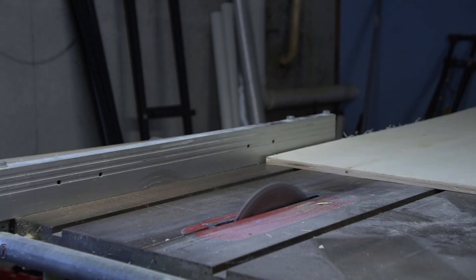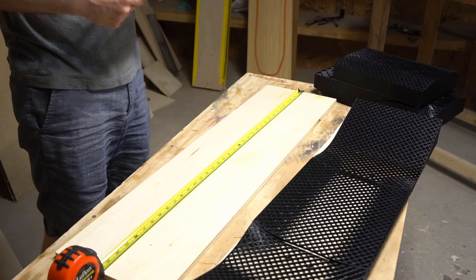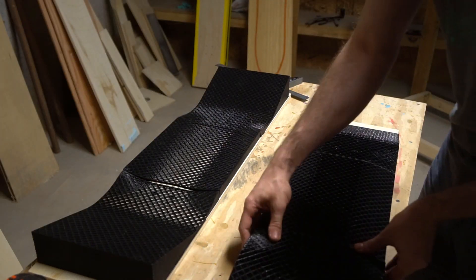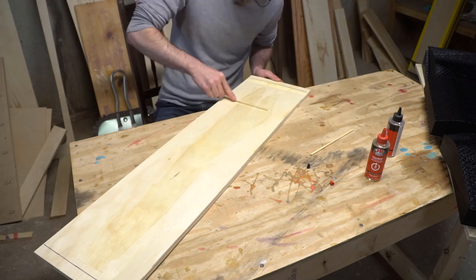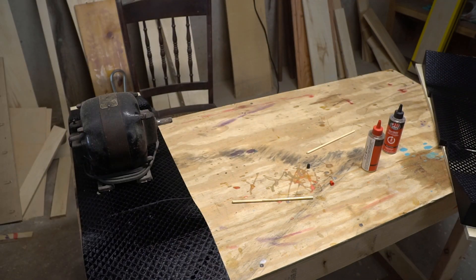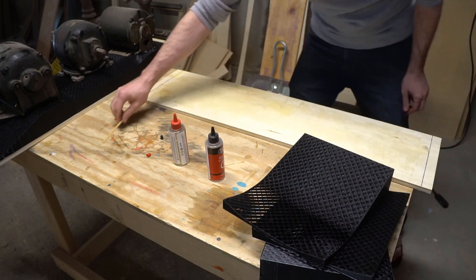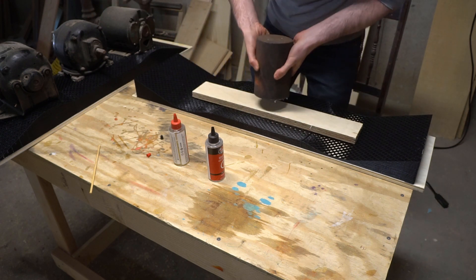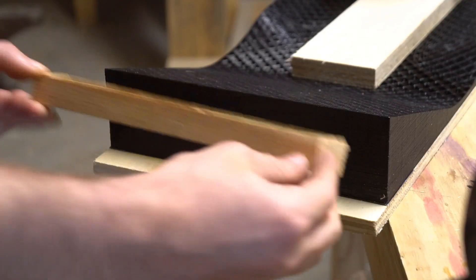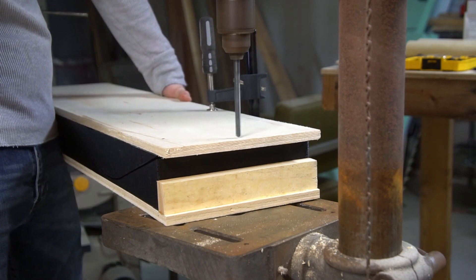The sections of the top and the bottom of the molds need to be joined together, and my favorite way of doing that is by attaching them to a wooden base. In the past I've used CA glue successfully, but this time around I'm trying a two-part epoxy, which ends up working out just fine. Once the mold sections were in place, I just used some heavy stuff to weigh them down while the epoxy cured. I also find it really useful to add some registration to my molds to make sure that everything stays aligned. Eventually I'd like to incorporate this into the prints themselves, but for the time being I've been doing it with wooden blocks and metal pins.